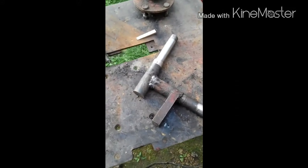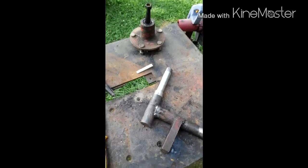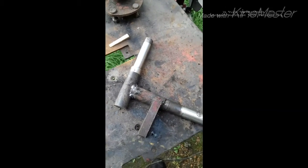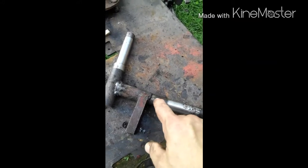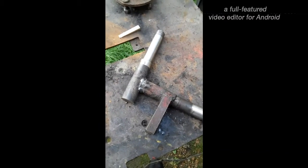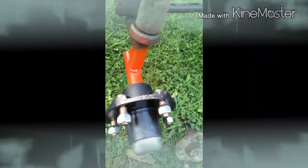I hope this saves somebody some money. I could pay somebody else to do it, but that wouldn't help. Anyway, that's it. When I get the one out and put it together I'll show you what it looks like. I can add gussets — I can gusset this out — but on that smaller tractor, really not worth it. This is the same diameter as this shaft, and it's already got a little bit of a bend right in here, just a little bit. Not about to hurt anything. It's going to be strong enough, and I'll just do some primer paint on there.